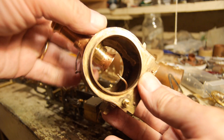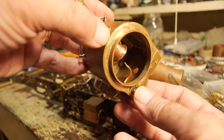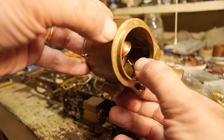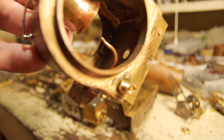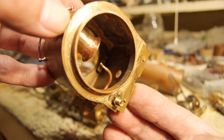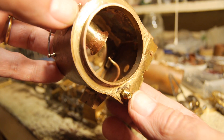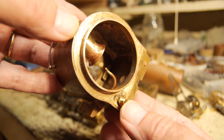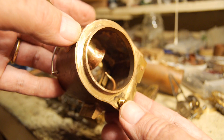This other pipe you can see is the blower pipe — a very small piece of tubing which I got from K&S. I've silver-soldered the two pieces together, which you can hopefully see in close-up. The two pieces of piping are secured together there with silver solder, and this is the outlet for it, which runs up to the take-off in the cab of the locomotive.